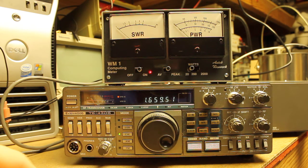I'm not quite sure what's going on there either — I think I may have two separate, distinct issues. If you've seen anything like this on a TS-430S, or if you have any ideas what it might be, let me know. My next video is going to be checking the relays on the LPF board. The only issue with that is the LPF board is tucked in behind the PA — the power amplifier — and it requires quite a bit of disassembly to get to it. That's why I was waiting on it until a little bit further in the process, but that will be my next step. If you have any questions, comments, or any kind of feedback, put it down below. I hope this video has been at least a little bit informative. We're a little bit over 500 subscribers right now and still growing well, so I'll have plenty more videos coming out soon.